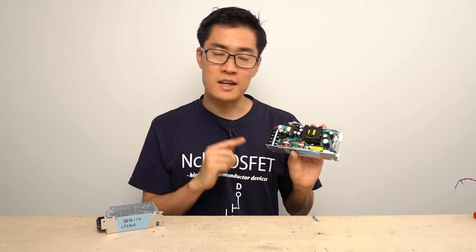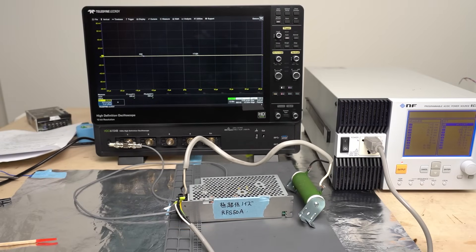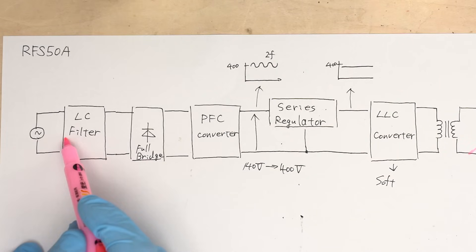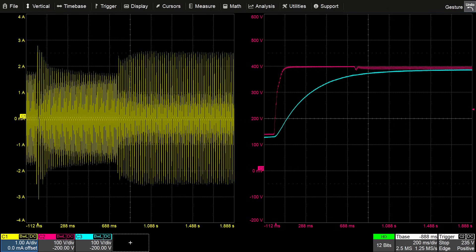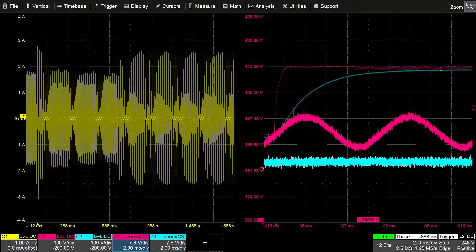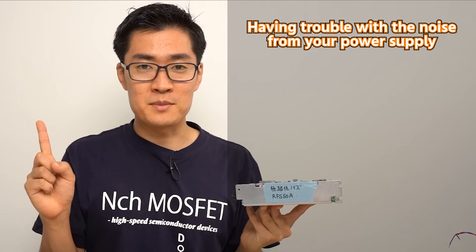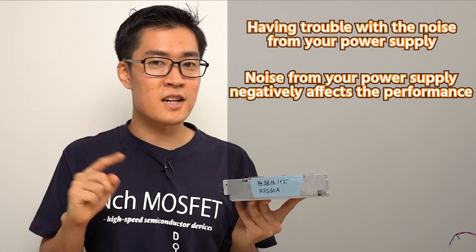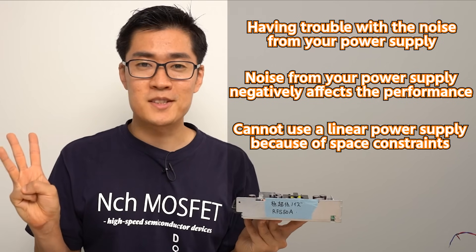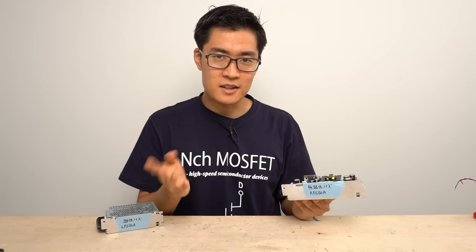In summary, these DITRON low noise power supplies are quite interesting — they are switching power supplies, yet their noise suppression level is as high as linear power supplies. An LLC converter reduces switching noise via soft switching, and a linear regulator eliminates low frequency ripple components. I strongly recommend these products if you are having trouble with power supply noise, if that noise negatively affects circuit performance, or if you want to use a linear regulator but cannot due to space constraints or discontinuation. Links are in the description. If this video was helpful, please comment, like, and subscribe.